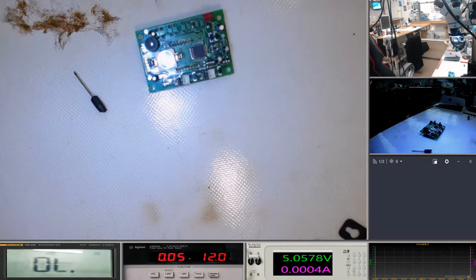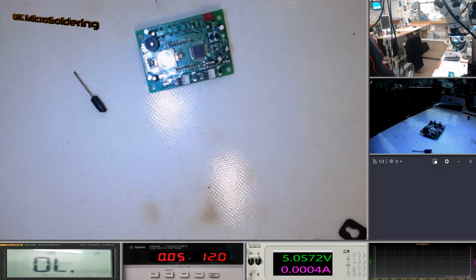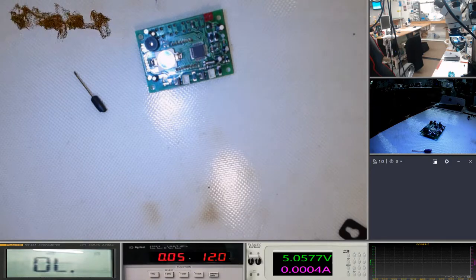The 0.5, that is a corrupted NAND. Is it giving you any errors when you plug it into iTunes? Yeah, plug it into iTunes. It's my feeling it will come up with an error. I can't remember, 401 or 4001. Whatever error it is, maybe even error 2. I can't remember. I know that it's related to the NAND or it's stuck in DFU mode. But that, again, is related to the NAND anyway. It could be a short on one of the data lines as well. Either way, it's not something you guys would be able to fix, I don't think. But if you can try and narrow it down, so if it does come over here, I'll be able to work a little bit quicker. Alright, cheers, mate.